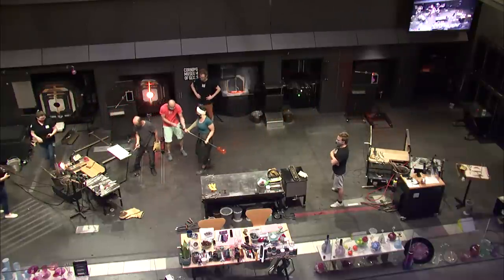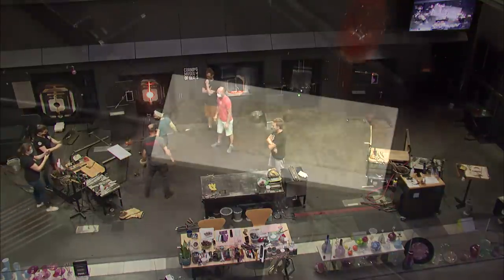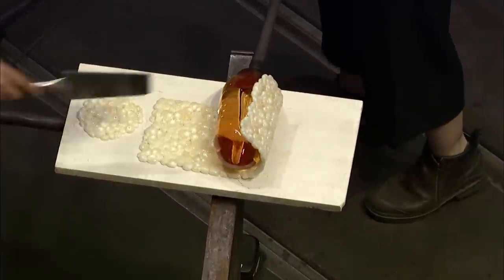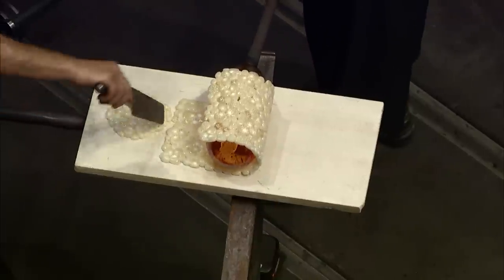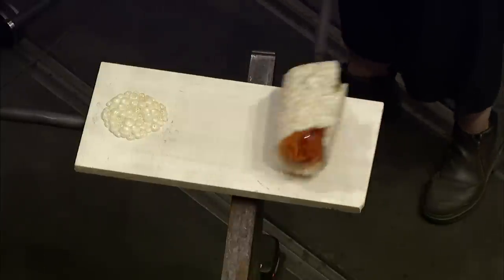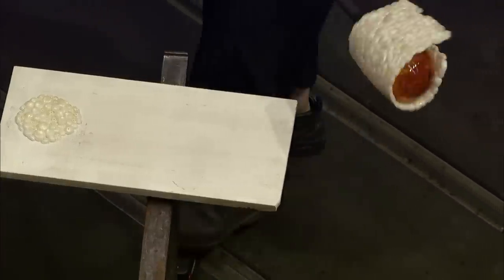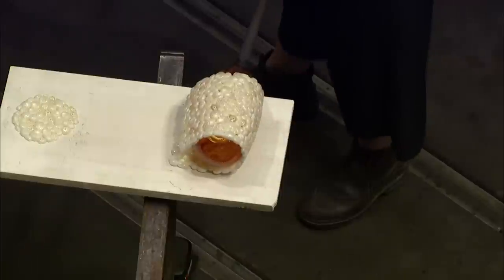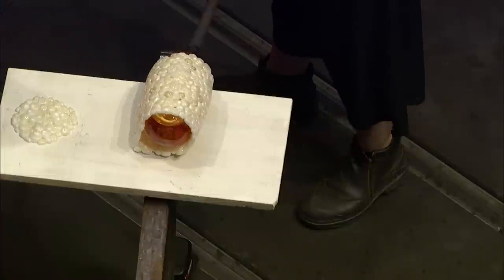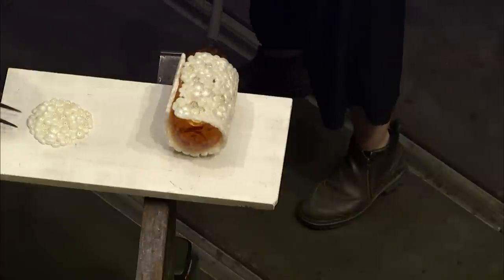You can see how Gio tests the corners of the pattern with the tag, lifts it up. You can see how the glass is bending and moving. Looks like it's got a really good heat. She tags it down and just gently rolls. She's inflating the bubble a little bit more right now before she goes all the way. She doesn't want it to overlap, so she's expanding the bubble. That gives her a little bit more diameter to work with on the gather, and just gently back and forth until she has the pattern completed on both sides.